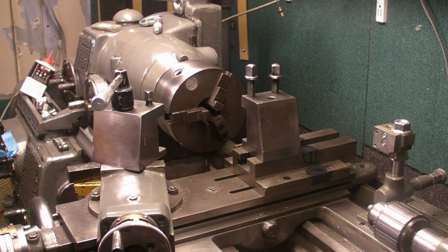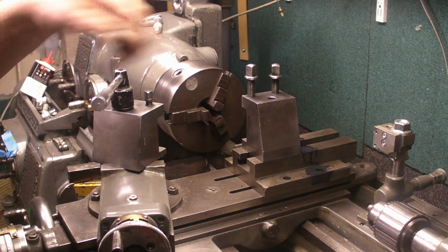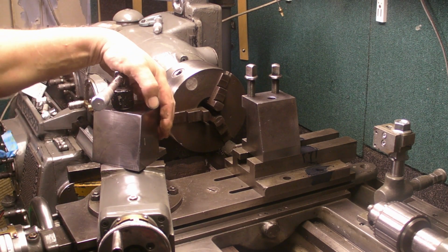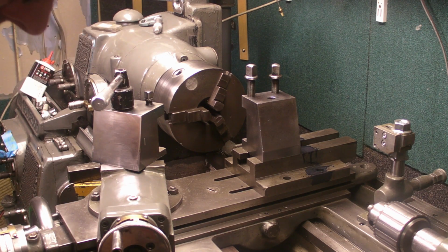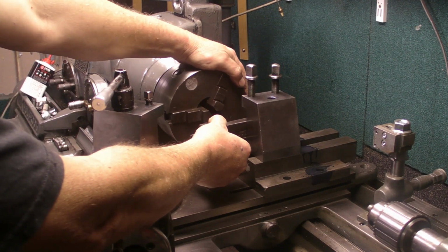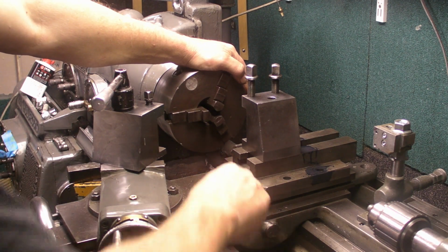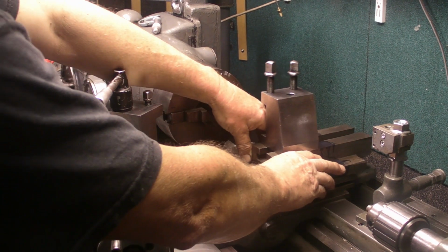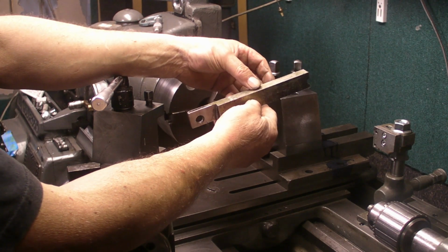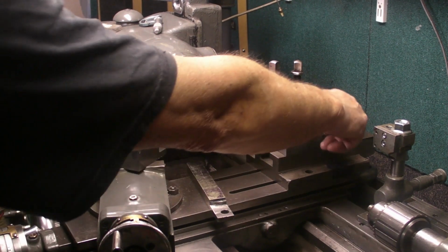So I thought that would give me a permanent setup for using the parting tools, and then I can forget having to mount them into this tool post. We just mount these upside down and obviously have the lathe running in reverse. Now, I haven't got any T-nuts of that particular size, but I have got some bar that I can machine some out of. I was thinking maybe two holes here and two at the back,